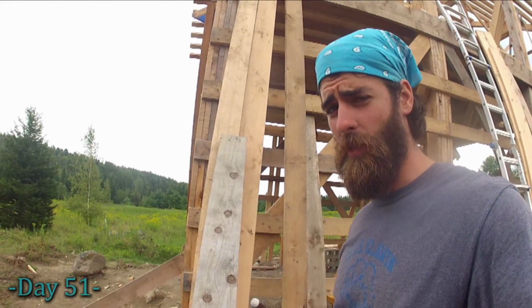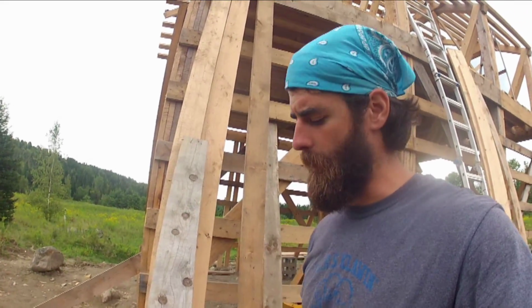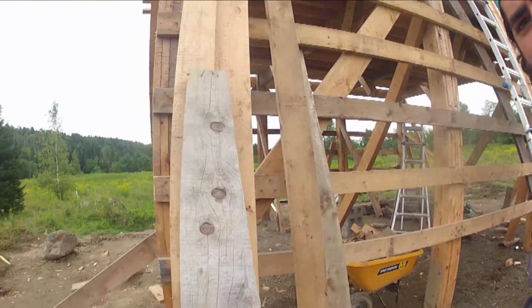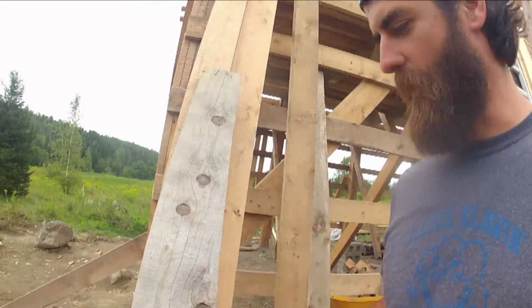When doing the structural engineering for a building, you're supposed to treat every knot in a board as if it were a hole, even if the wood is still there. So if you had a board like this, with a lot of knots running through it, it wouldn't make for a very good floor joist. People might question, well, why would you treat that as a hole?